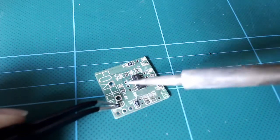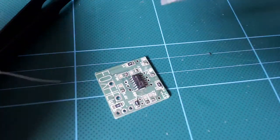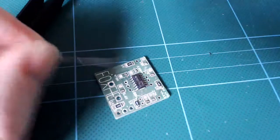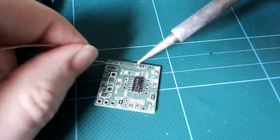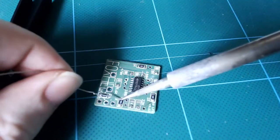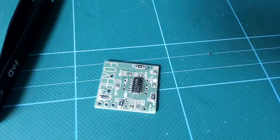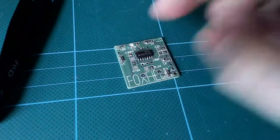Once you've got it in place, you need to solder the other end. You could do that now, or you could wait till they're all in place and go around the board filling in the rear pads. I tend to fill in the second pad for each set of values at a time. Filling in a rear pad is easy. Take your iron and carefully place it against the unsoldered pad, just touching the edge of the component. Now feed the solder into the pad, and it should just flow between the pad and the back of the component, making a neat ramp.